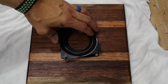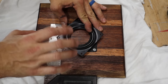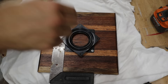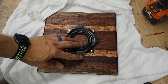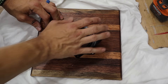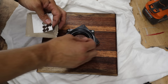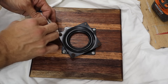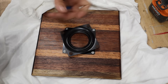Just want to make sure the screw head doesn't stick up and interfere with your rotation. I'm just going to take a square and square that edge up. As long as it's close — you're not building a clock, so it's not going to matter an extreme amount. When you're pre-drilling, especially as thin as this piece is, you want to make sure you don't drill all the way through and punch a hole on the other side. One good thing you can do — like on our other Lazy Susan — is add a cork circle bottom. You buy those at any craft store or Walmart and hot glue it on there to protect your tables. Or I have some felt stick pads — just stick-on felt pads — one on every corner. That'll keep it off any surface from scratching it.